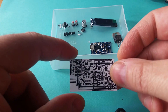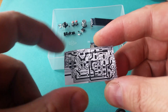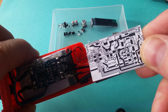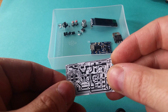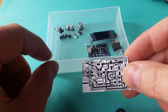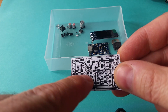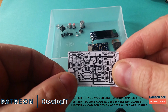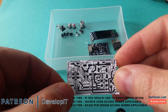The next stage is to put together the surface mount board. I've laid out a circuit design in KiCad and I've printed it out here at actual size. It should hopefully fit within the soldering iron body, but it's going to be a very tight squeeze and I might have to do some more modifications. I've got some of the components I need for the surface mount board but still need to order a couple. It's going to be an interesting task — some of the track traces are quite narrow and placing the surface mount components will be tricky, but the software has been tested to the point where it should thermostatically control the soldering iron.